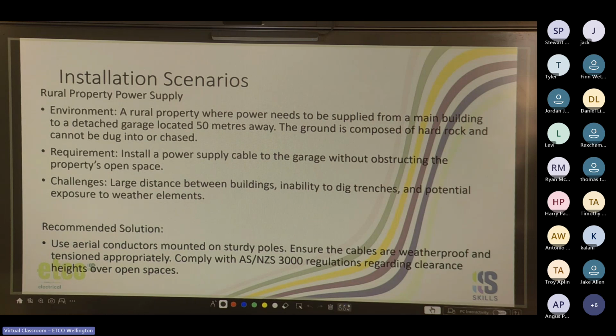Test the coil. So with this, you guys would probably use hard drawn neutral screen. So it's a bit stiffer, and attach it either end to a pole with dead ends and bobbins. Probably quite a bit too far for cat wires. You may have to use multiple poles throughout, especially if it's 50 meters. Maybe a pole every 20, maybe even 15 meters.